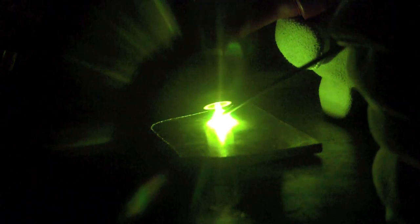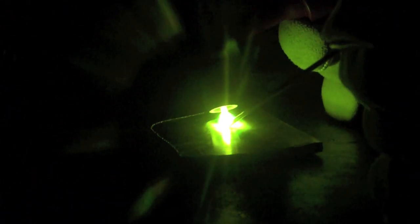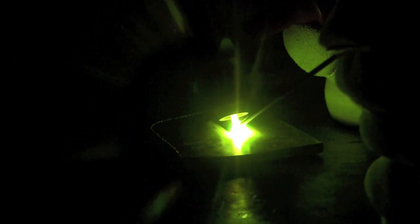The first thing you'll notice about welding with the 200EX is how crisp the start is. The high frequency really jumps off — it just lights up really nice and gives you a nice continuous flow. On the AC hertz, I'm dialed in here at about 133 hertz. That's a nice compromise between being real wide at 60 or at 250, which is a real narrow arc. I prefer this type of puddle.